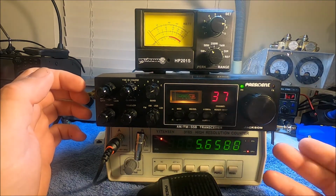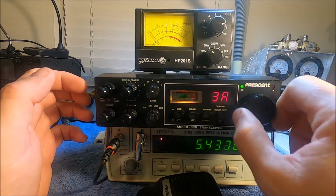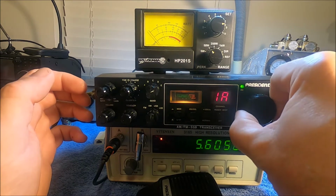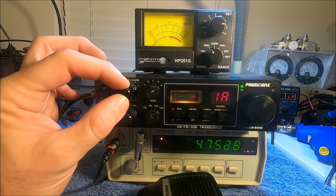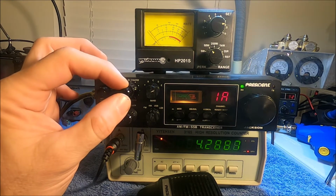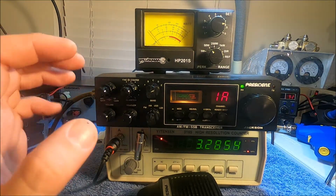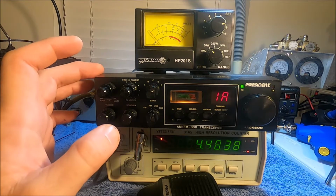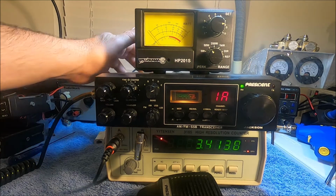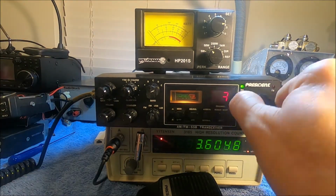I see here we have actually the selector, all the channels showing up, but we're missing a little bit on the segment. So we're going to have a look at that. I also got to do this coarse knob, clarifier, coarse fine control is wiggly, the whole pot. So I know I'm going to have to take this faceplate off to do that. I should have done that, but just trying little by little, having a list of things that need and can be done to this radio. Took that wire out the back. Everything looks good. So here we are spinning through the dial here.